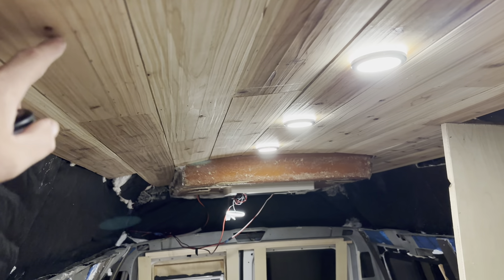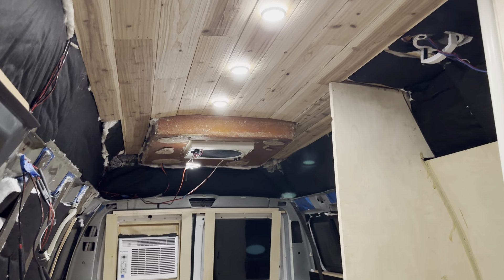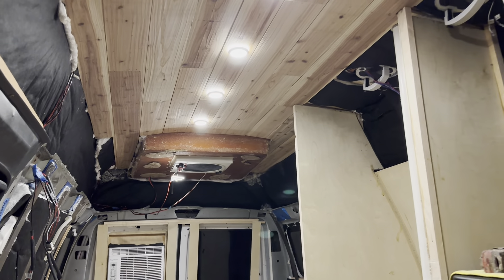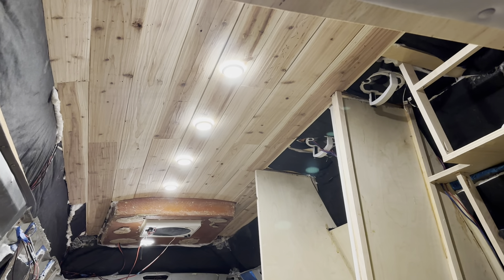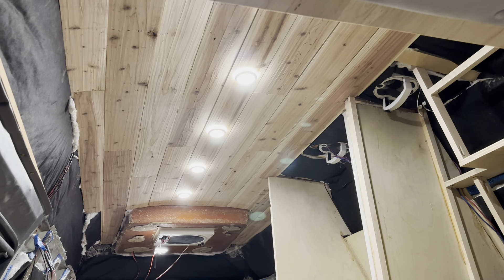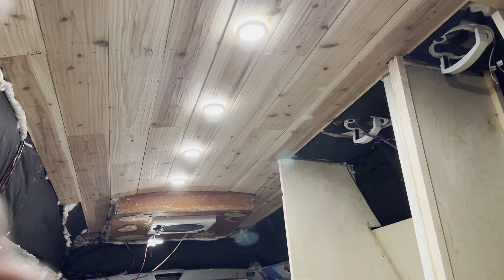It's going to have some striations from the planer and so forth. I'm going to use a water-based polyurethane on this as opposed to that oil-wax finish I used before. A little pro tip: when using water-based poly on particularly soft or light-colored woods, it will not yellow the wood as much as an oil-based finish. It'll actually do a pretty good job of keeping it in its natural state. It's a little hard to see here but that center plank...